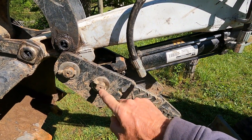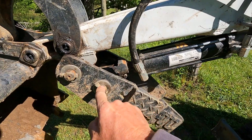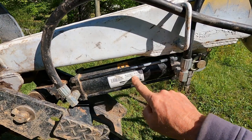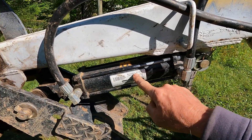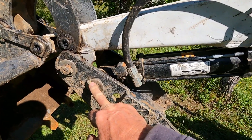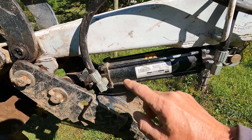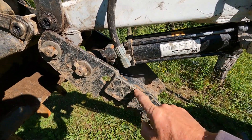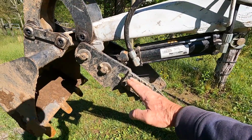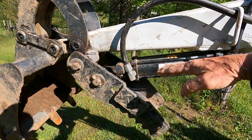If you get a thumb, you have to drill a new hole and move it down. And like I said, I went from a 10-inch cylinder to an 8-inch cylinder. But even with all of these modifications — moving the hole and getting a shorter cylinder — the thumb still doesn't retract fully, which I'm not happy about. This thumb should retract all the way tight against this cylinder.